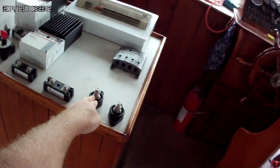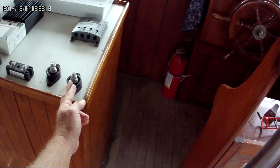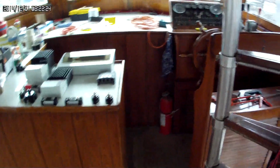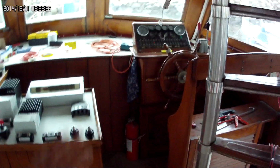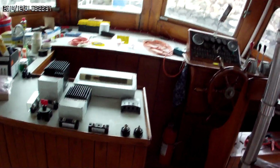So I'm going to be able to handle more than 500 amps if I would want, straight up to this. That's on the negative, and then I've got the 2 on the positive. So I connect that, and then down to the bus bar. It's a 500 amp bus bar. Life is good. Very little loss. I've calculated my loss for these wires. I'm calculating my loss and making it an efficient system. So that's how that's going to work, and that's how I'm going to get that there.